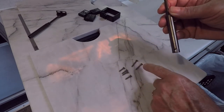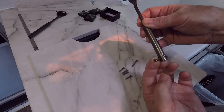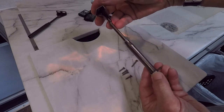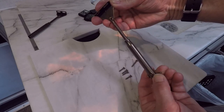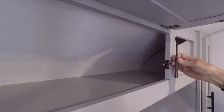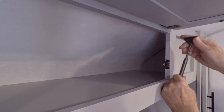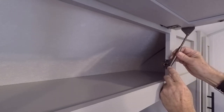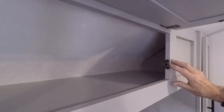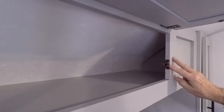You'll have a package containing two pivot screws and your mounting screws for the top bracket. The screw goes through the bracket into your frame — make sure it is lined up this way, not this way. Since this did not come with any directions, I went online and found out that you line up this spring so the dimension from this hole up to the top of your frame is five and a half inches. I'll remove this piece of hardware, measure five and a half inches, and drill a pilot hole since this is particle wood.